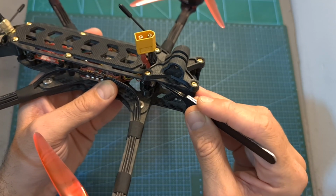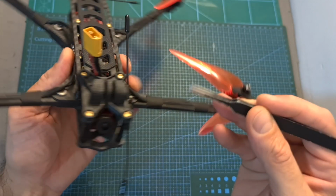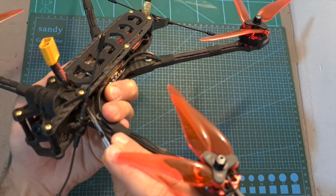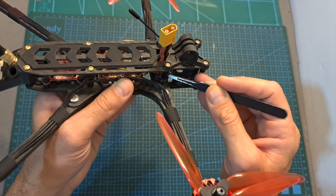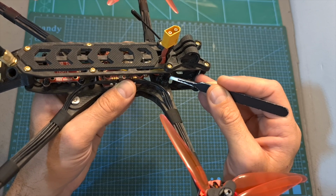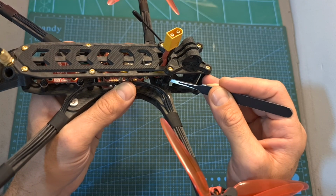Inside the frame, mounted inside the 3D printed TPU part, you can find a self-powered buzzer. Its position is pretty much going to make sure that the buzzer is not going to be blocked, and once the main battery is going to be unplugged, the buzzer is going to start beeping and its onboard LED unit is going to start flashing, which in conjunction with the GPS unit is going to hopefully enable you to recover the drone in case of a crash.